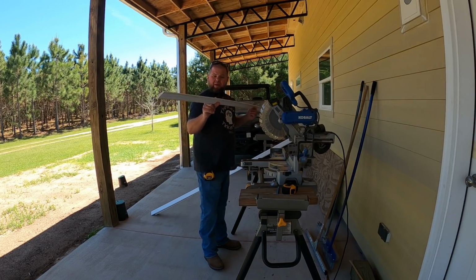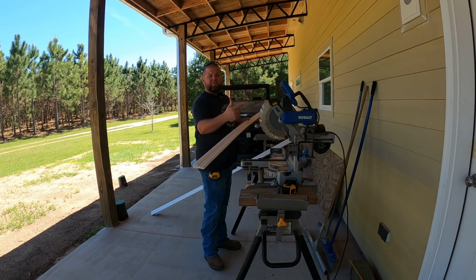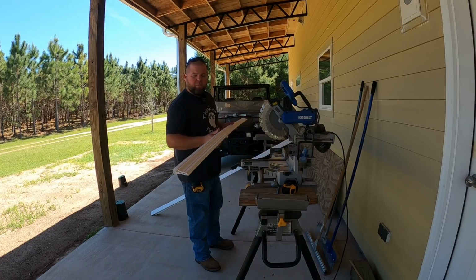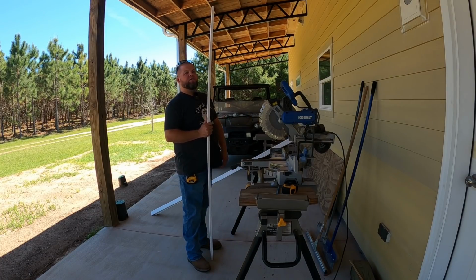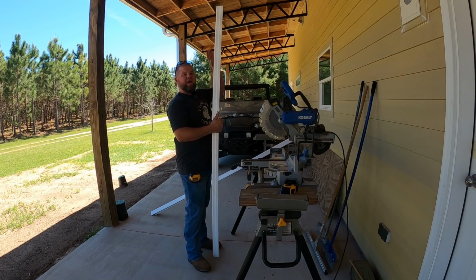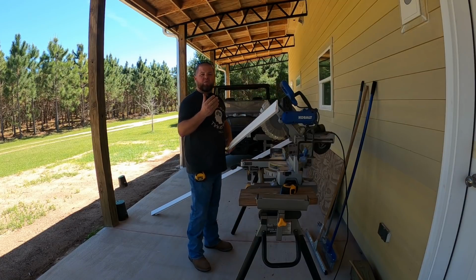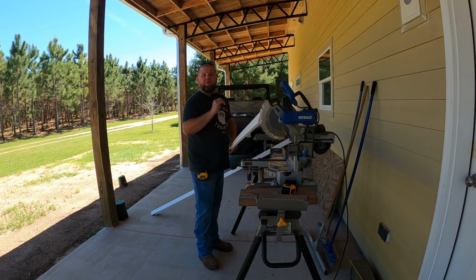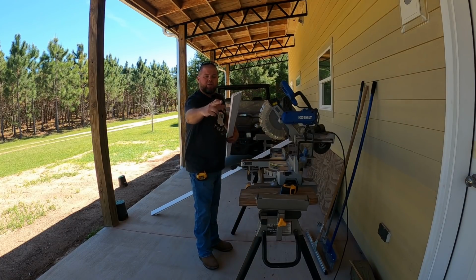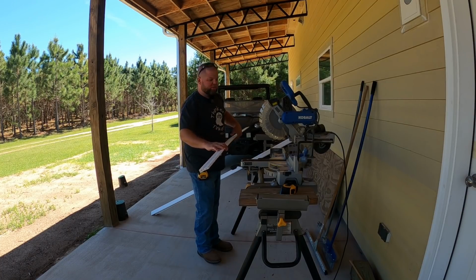But the good thing about 7 foot is you'll wind up using, let's see, it'll be a total of 5 pieces to trim the inside and outside of a standard height door. So we're just a little under 7 foot to trim out either side, and then you'll cut one of these in half to do your top cap, and you'll wind up with very little waste this way. If I had bought, say, 8-foot trim, I would have wound up with a ton of waste and little end pieces that I'll never use. So I'm happy to see that they offer these in 7 foot.